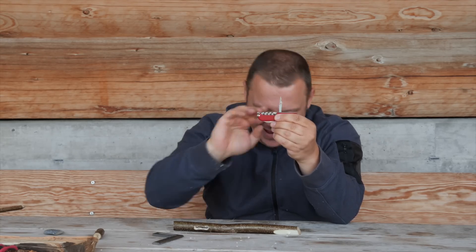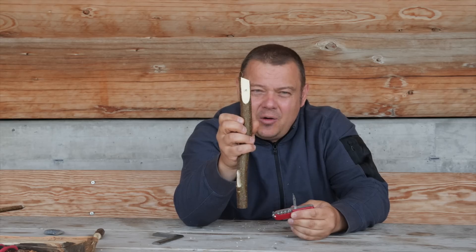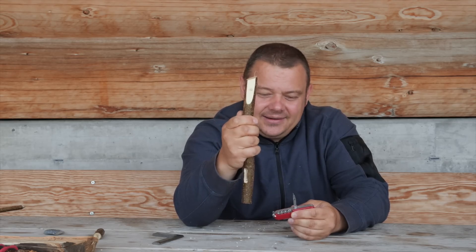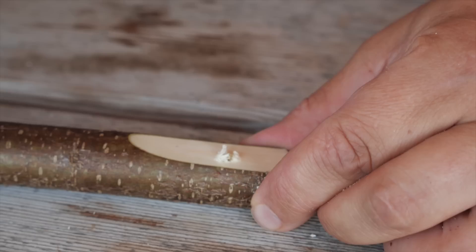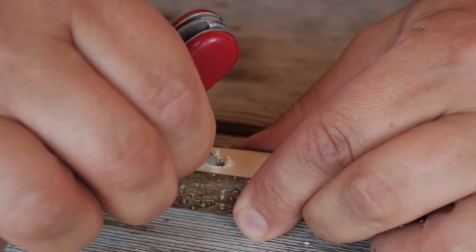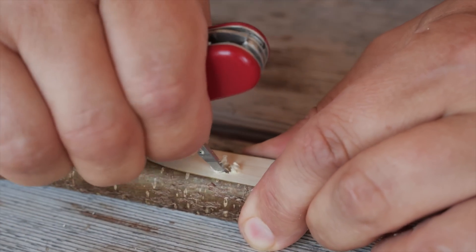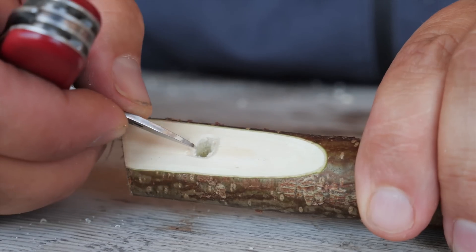Of course this is not exact, but for most uses it works perfectly. The reamer has a sharp cutting angle of about 48 degrees, and this is enough to cut away wood. So if you want to clean the edge of a hole at the entrance and at the exit, you can cut away the wood. For that, hold the reamer like this, put the reamer edge diagonally on the edge of the hole, give a little sideways pressure, and make this movement. Now you have a nice and clean edge.